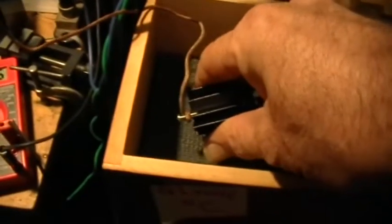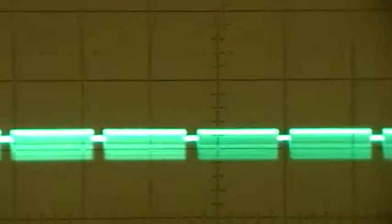Yet the MOSFET is still in place. It's still warming up perceptibly, and it's still heating the load. We're up to just slightly over 100 degrees Fahrenheit now. Okay, so we're showing this trace. We have oscillations and no indicated current flow. That's up a little bit because of the baseline drift. Let me get that exactly back on the baseline. So we'll go back to the display.